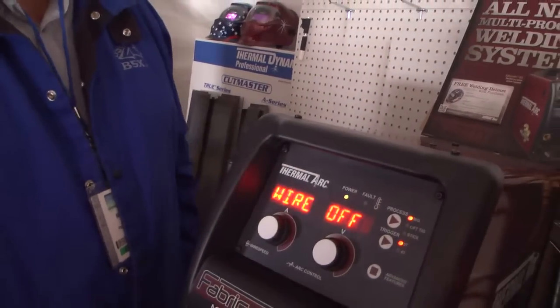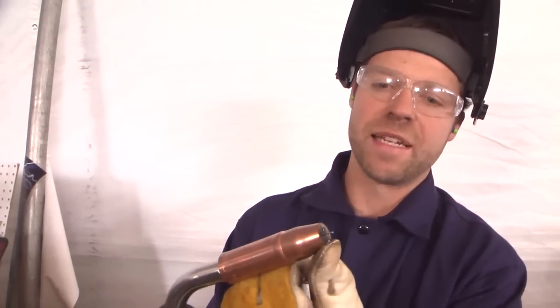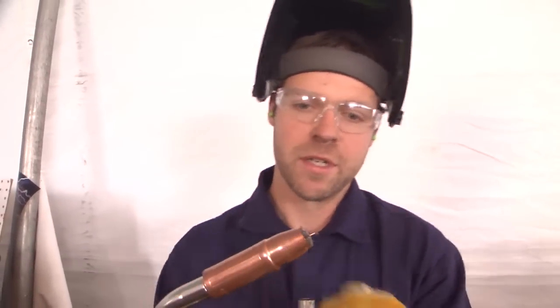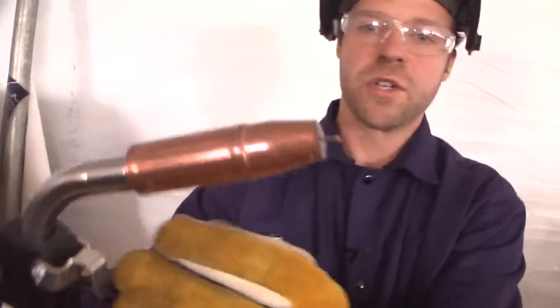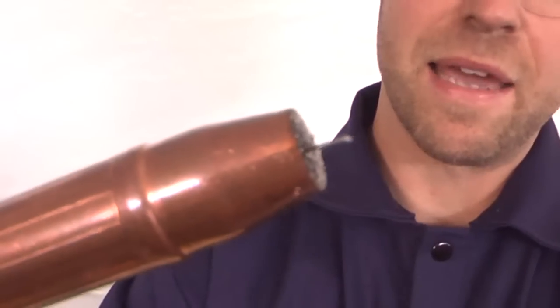This is wire sharp off. With wire sharp off, the end of this MIG wire is going to have a larger ball than you would typically want, and typically you would snip that off with the pliers. Wire sharp off left a little BB at the end of the wire, which guys will typically be trimming off.